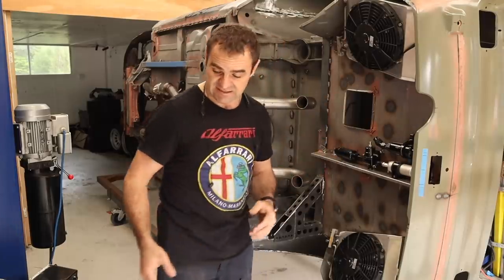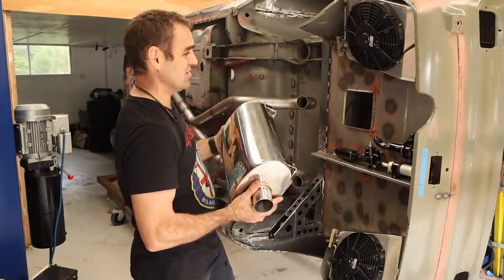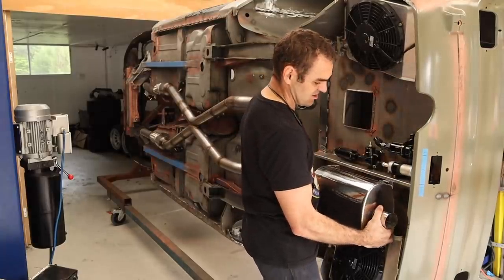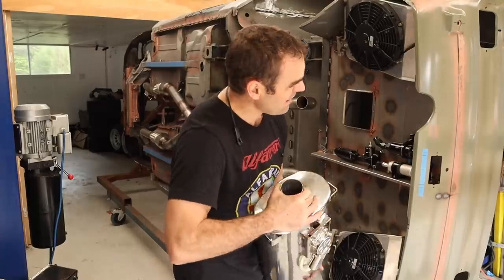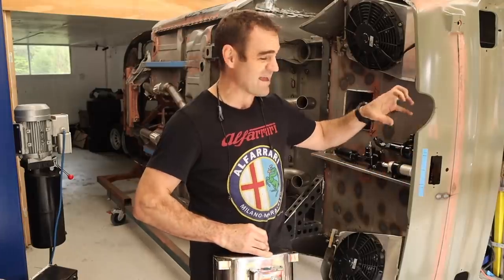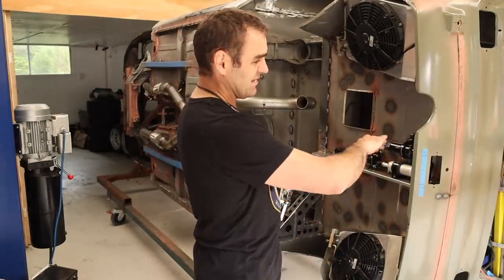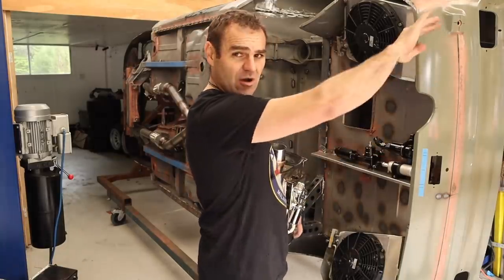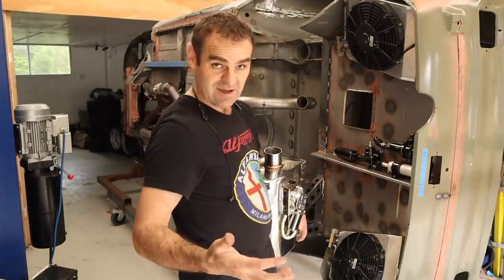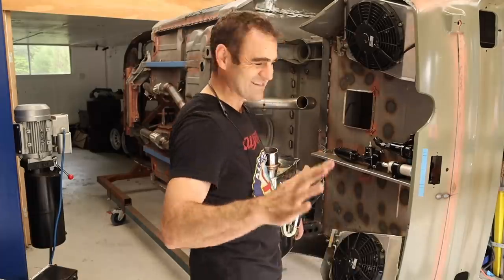With the mufflers, they're actually still quite a large physical unit, and I've got a space just right here and the equivalent space just down here where they can go. I've marked an even space on the back where I want my mufflers to come out, so I'm going to have to cut this rear valance and remake it to shape around these mufflers, because the original muffler comes out on an angle on the 105 — which is why it's got this odd-shaped cutout here. These are obviously not going to come out that way; they're going to come out straight, so I'm making a whole new rear lower exit for that.